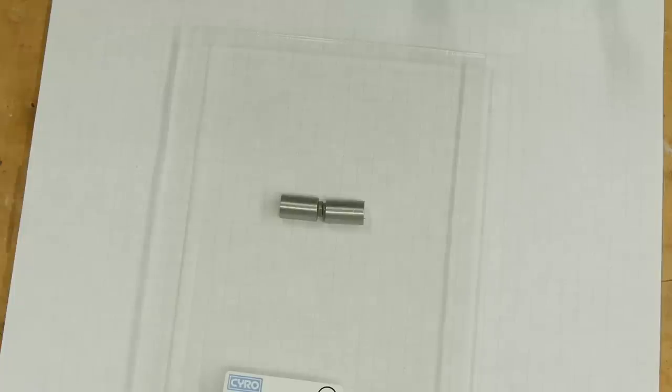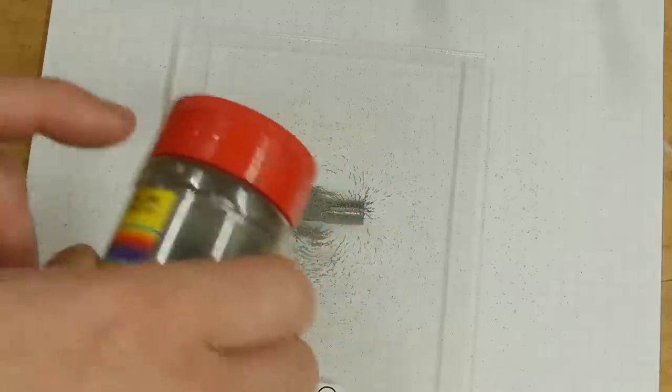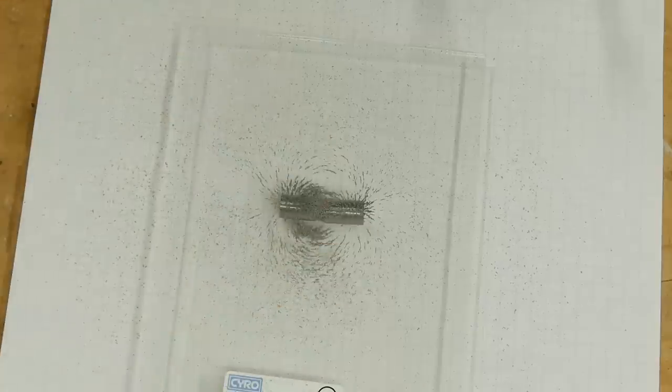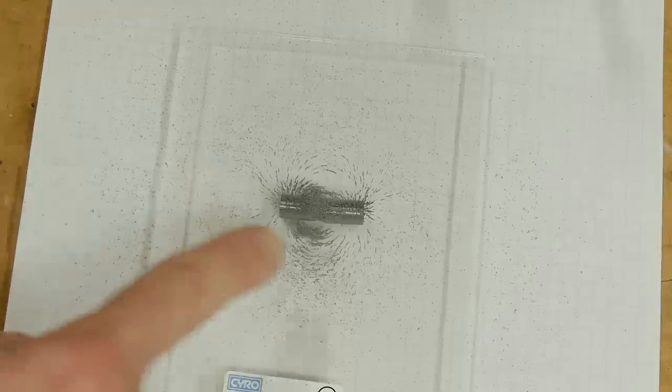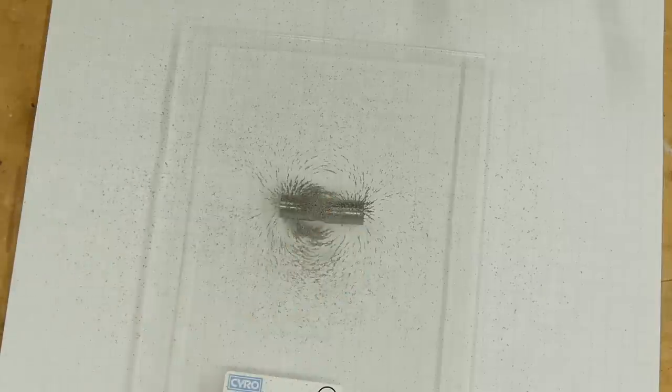It helps to visualize what's going on, so I took the magnet with the two steel pieces out of the circuit and I'm going to sprinkle some iron filings on here. There are field lines flowing out of the ends and making a circuit, even in air — everything is a magnetic circuit. The trick is that electricity really doesn't want to flow through air, so we can usually neglect it in electric circuits. But with magnetics, even though the field doesn't really want to go through air, it can still make it, and we could do the analysis to figure out how much is flowing based on the reluctance of air.